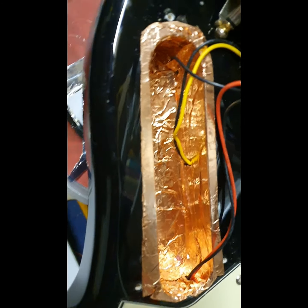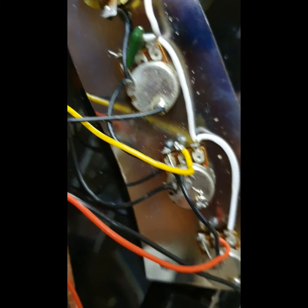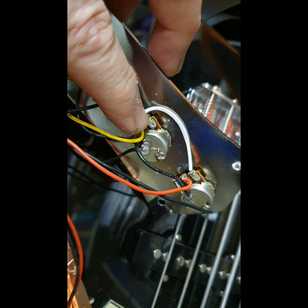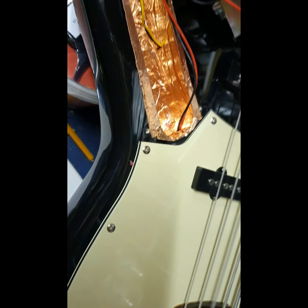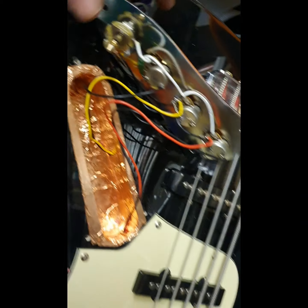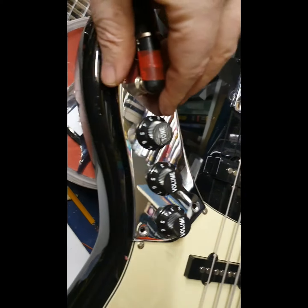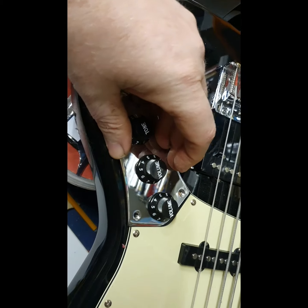It doesn't have to be pretty — you just need to make certain you don't touch any of the bottom parts when they go in. I also noticed the earth here is not a particularly good piece of soldering, and the earth line to the bridge wasn't making very good contact, so I reflowed that. You can still hear some noise in the air if you listen carefully, but when we close this down it goes pretty quiet — that's already a promising sign.